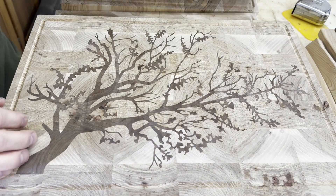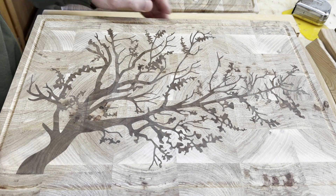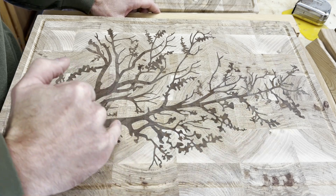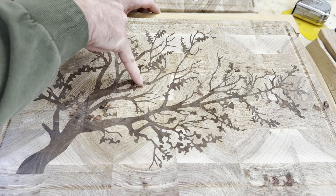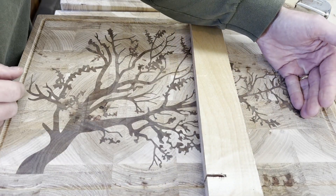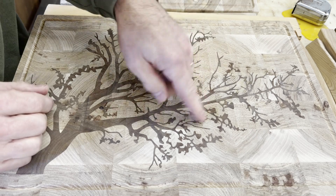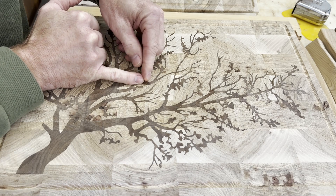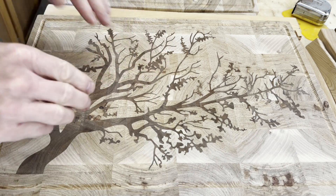The gluing time is one of the major time increases on this kind of multi-step project. I broke this one up — it's too big as far as the plug goes to try to glue up a blank and cut it all in one and try to get glue in there within the working time. So I broke it into thirds, and it's pretty much a perfect matchup — there are cut lines right there, but unless you know where to look I don't think you'd ever find them. I machined the last third at the same time, glued up smaller plug blanks for each, pressed them in, then came back and machined out the center and put that plug in. I modified the file for the center piece to overlap just a tiny bit into what would now be walnut, so it gets a clean matchup.